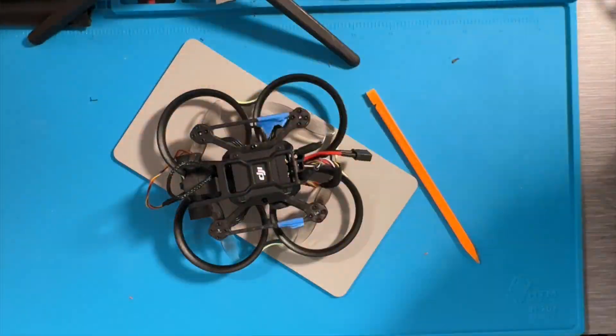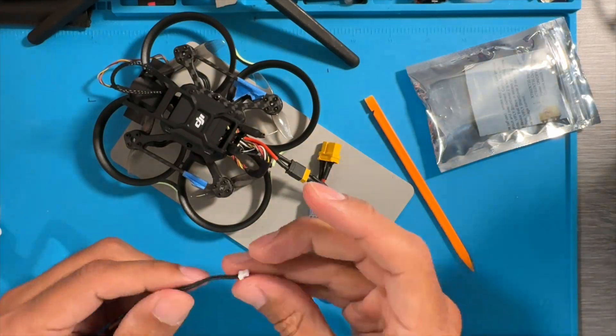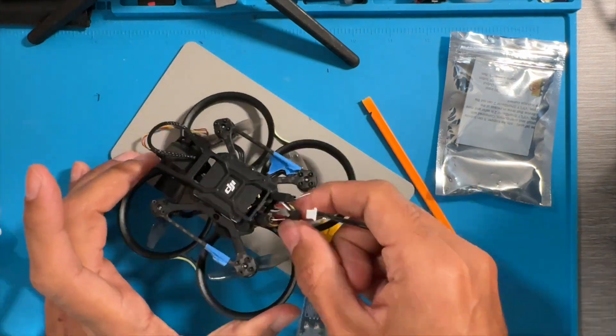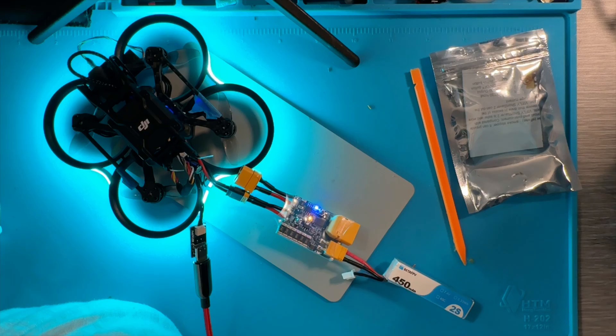Taking it apart and putting it back together — there you go, it's ready to go. This is where the smoke stopper comes in. Even though you check for continuity to make sure everything is good to go, the smoke stopper does the same thing but stops the power from going through so that nothing shorts out. Most likely you would get a red signal, but in this case everything worked out really well — there was no short circuit and my solder connections were good.